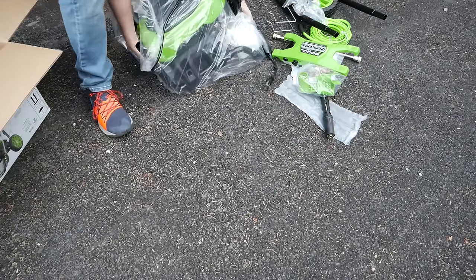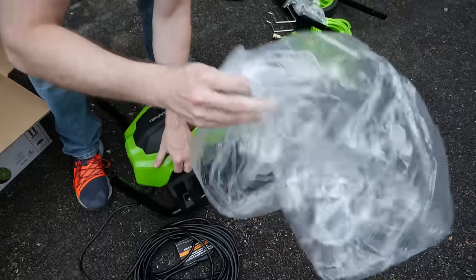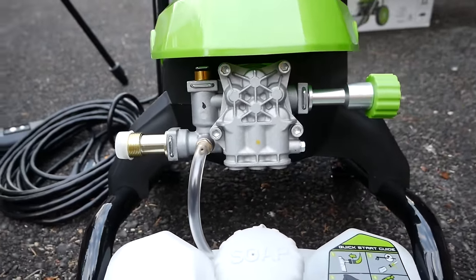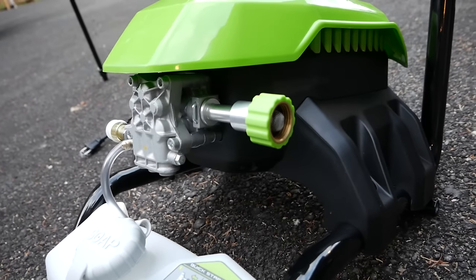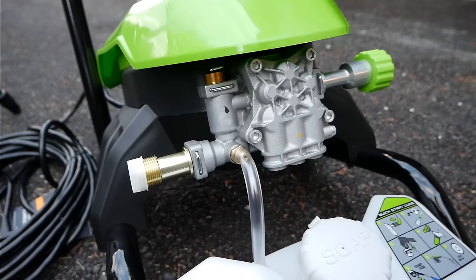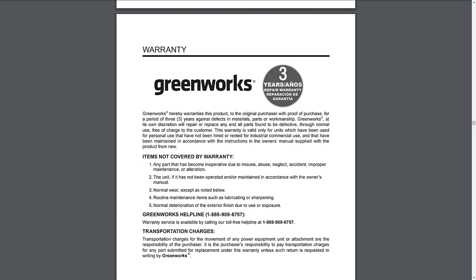The pump and motor feel very solid. You get the impression that under that nice-looking plastic hood there's a lot of steel and aluminum — this was apparent before even removing it, as the entire box with all its accessories was much heavier than expected. Taking a close-up look at the pump, everything appears very well built. Little things like an all-metal exterior and socket cap bolts give the impression they didn't just build the cheapest pump possible. One minor downside: the water inlet and high pressure outlet are on opposite sides of the pump — we'll get to why that's annoying in a minute.